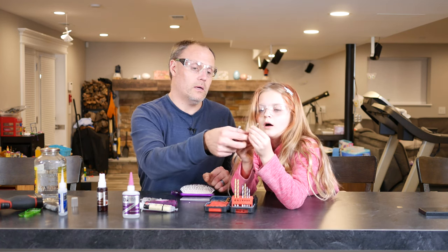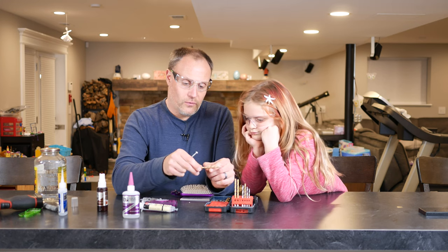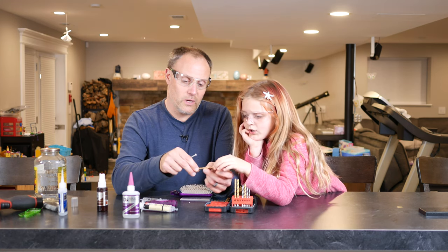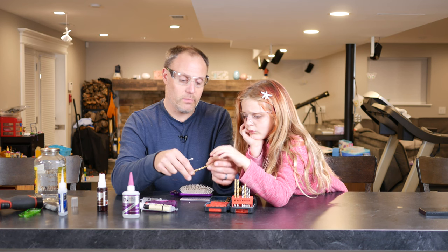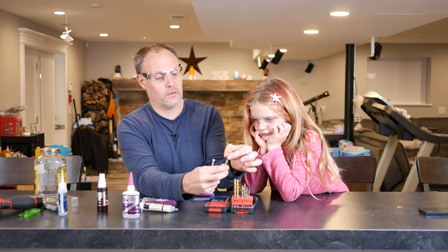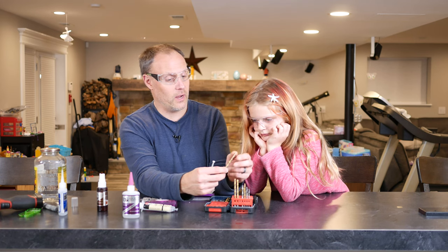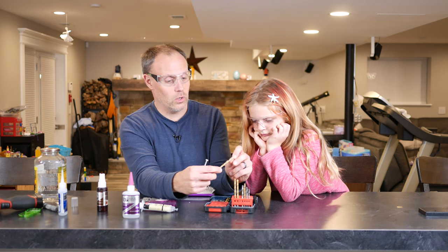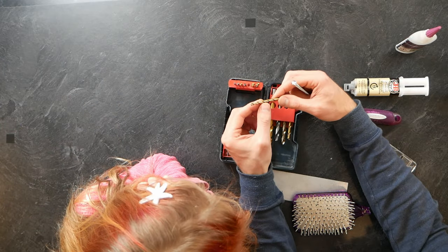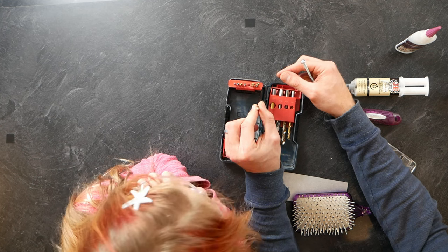There you go. Now on a drill bit, these flutes right here, this is what takes the material out of the hole. So when you're drilling in wood, this is what gets the chips out. But this can be sharp, so when you pull out a drill bit, make sure that you grab it good and tight, and don't let your fingers slide on those grooves, or else you can cut yourself, okay? The real cutting action on the wood or the steel or whatever happens up here, but when you pull this out of the holder, sometimes this can cut you, so make sure you hold it good and strong, okay?